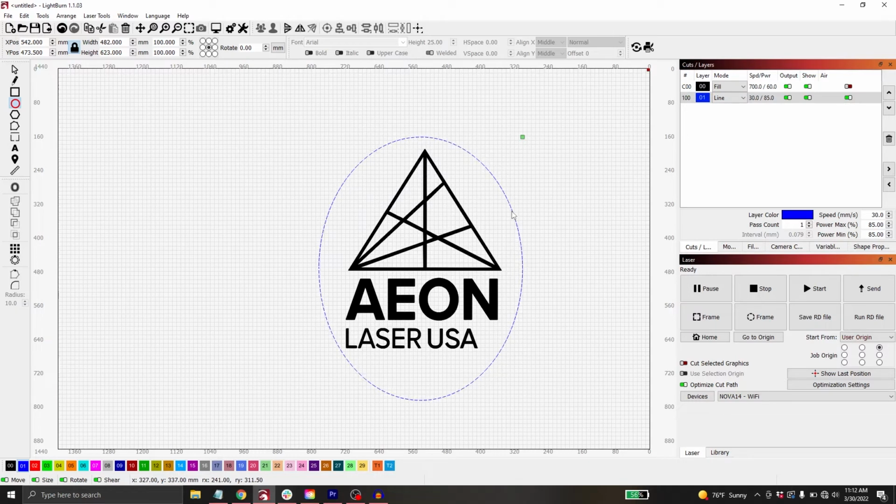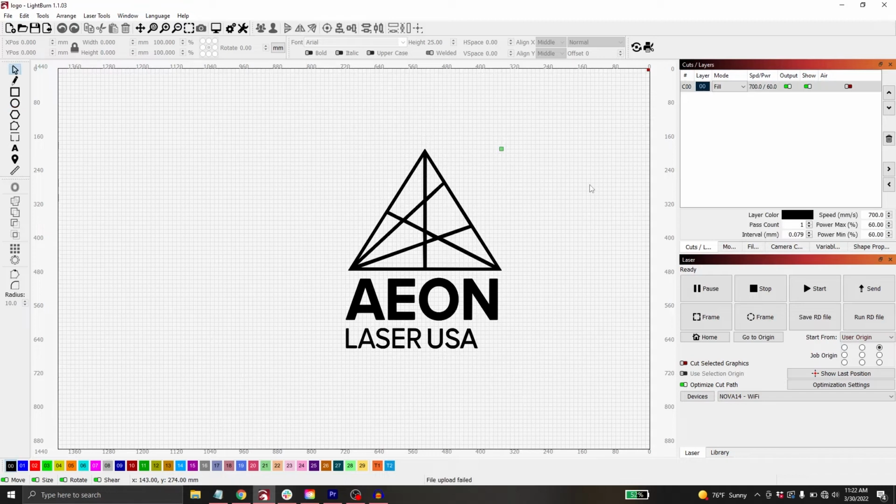I just wanna do an engrave here, so I'm actually gonna delete this line that I just made, and I'm gonna leave my engrave. So now that I have my file positioned how I want it, I've got my settings how I want them, I'm ready to send this over to the machine and start running it. So I'm gonna come over here into my laser window again in the bottom right, and I'm gonna click on send. It's gonna ask me what I want to title this file. I'm just gonna call this Aeon Logo.